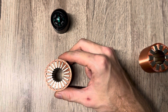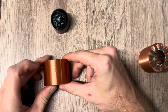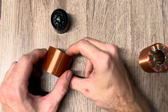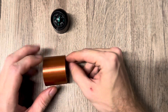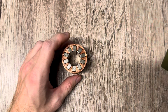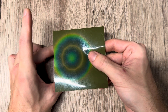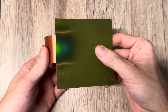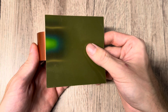I will show you this in several examples and explain why this happens, including some things about polarity itself. Here you can see on this side we have the south pole, and on this side also south pole, and on the outsides it's all north pole. Same goes for this array — south pole over here, south pole over here, and all the outsides are north pole. I'll quickly show you this under a magnetic viewing film — the white line separates the polarities, and as I go further away the ring grows.